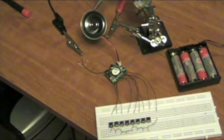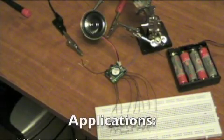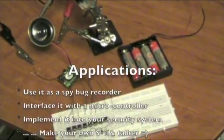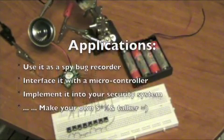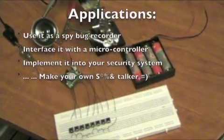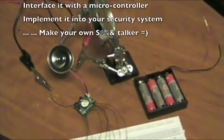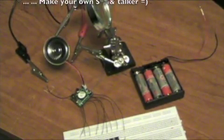As you can see, I've got a speaker hooked up to it and I've got eight buttons attached to it on a breadboard. I've got a battery pack — six volts — because that's the normal operating voltage. Five volts will work, but the voice sounds a bit droned, so six volts is optimum. Right now I'm using my DC power supply, so I can use both the DC power supply or the battery pack there.